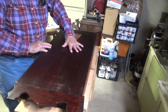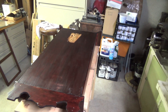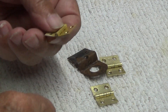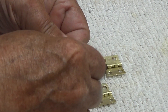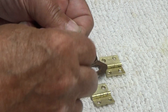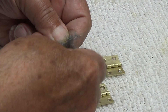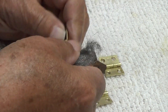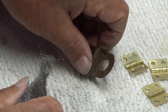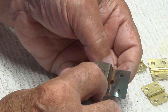These have been put in with nails but I think we'll end up using some screws to get that in there. We had the hinges soaking to get the garbage off of them. Right now I'm just taking some steel wool, doing some final cleaning on the hinges, and we'll get those cleaned up. We'll probably put a little coating on this. This hanger has got quite a bit of rust on it — I can see it was blued steel, so we'll clean this up and chemically re-blue it.